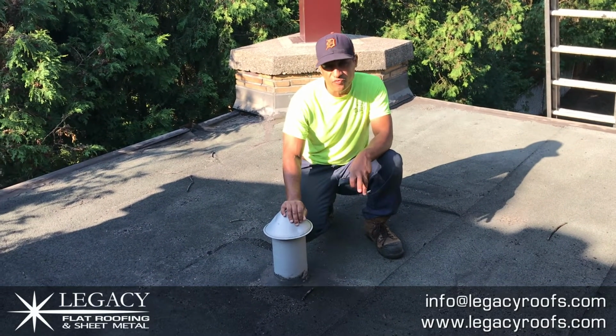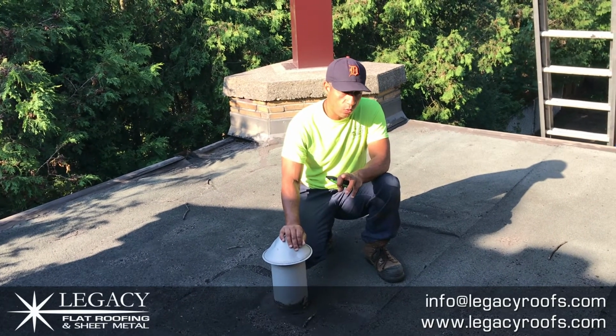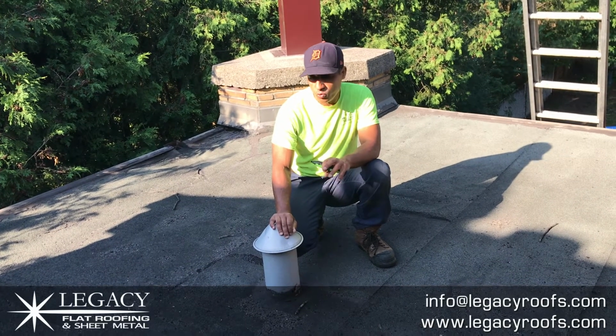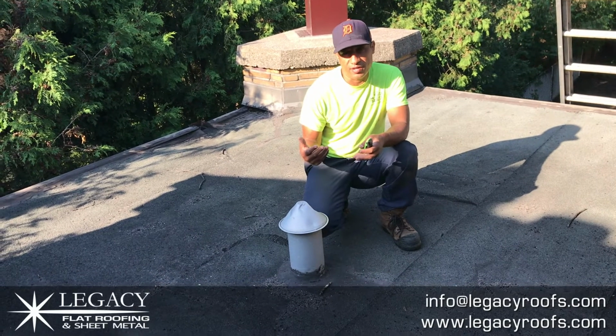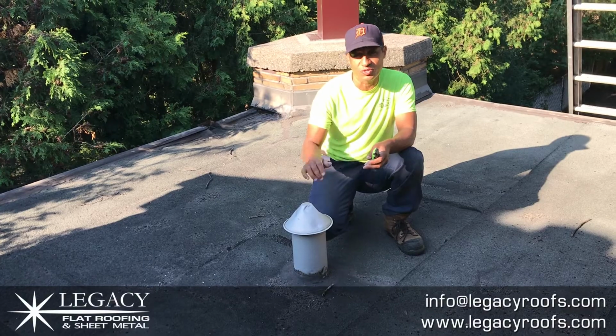So we're going to rip the roof off, make sure the deck board's good before we put anything on, and put on a new 2-ply modified bitumen system. We'll show you what it looks like ripping off a roof, inspecting for any wet deck boards, and then replacing them, and then put on the base sheet. That's the plan for today. Show you how it goes.